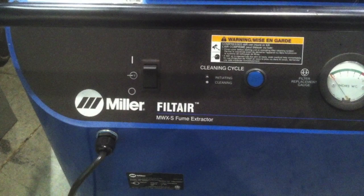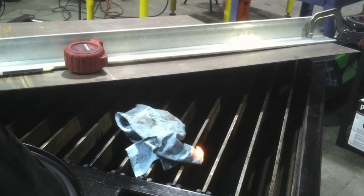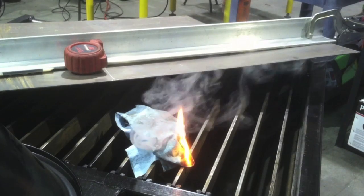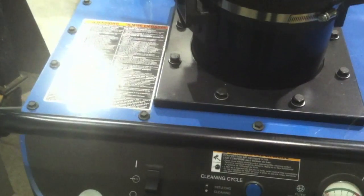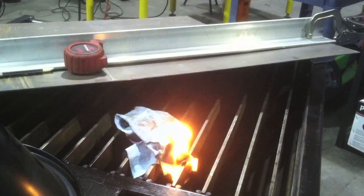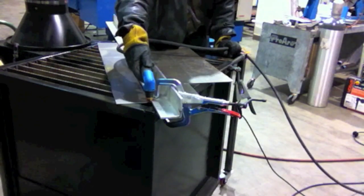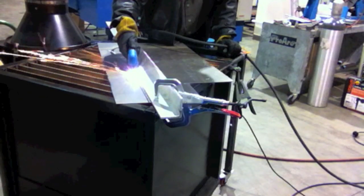So it's a Miller filtered air fume extractor, and I'm going to show you how this thing works by lighting a paper towel on top of the grate. You'll see it starts smoking pretty good. There it comes — all going up. Then I'll flip the fume extractor on and you'll get an idea of how well the downdraft function works. Now you see the smoke, and now you don't — smoke's going all down, being filtered instead of going out in the shop. That's the way it's going to work for every plasma job, cutting torch job, or welding galvanized job I can put on here.